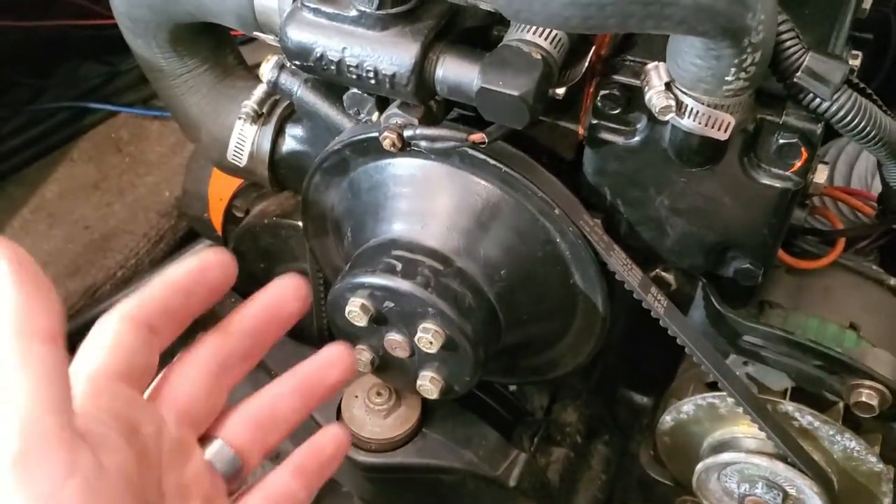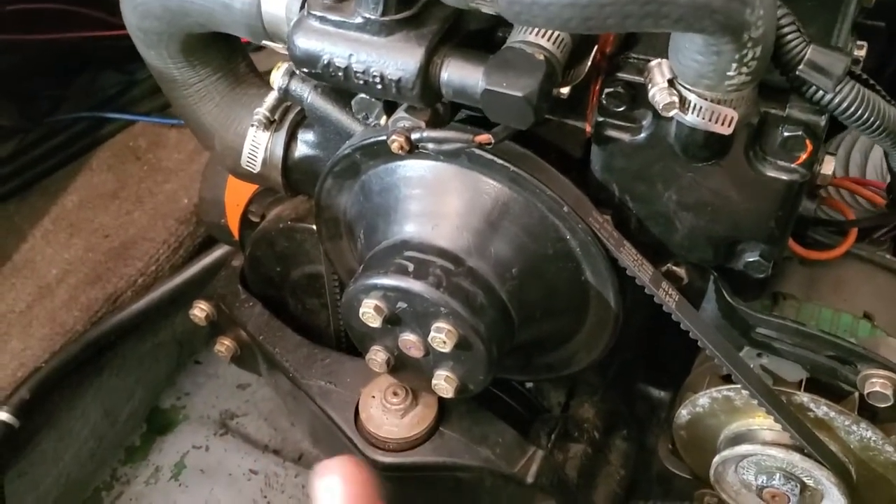I'll have a link to all of these parts in my descriptions through a credible website, mostly Amazon. When it comes to these engines, running this on the muffs is going to be your best friend because you're out of the water, you're on the boat trailer, and you're going to be able to see what the boat is doing. Get it out of the water, get it on the boat trailer, put the muffs on it, start it up and run it, and stand behind the boat and make sure water is coming out of the exhaust. If there's no water coming out, shut it down immediately and start problem solving. I would almost always start with the out drive because from my experience, that impeller is probably burnt out — and it could burn out from other reasons, like a really sandy lake where sand gets in the out drive and acts as sandpaper on that rubber, or if it was poorly installed.